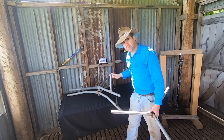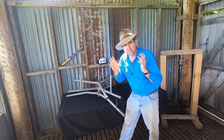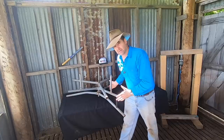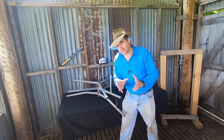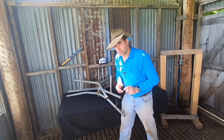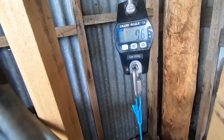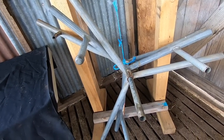Be careful when using these spinners to start and finish your run very slowly. The advantage with buying this sort of spinner is that it's as cheap as dirt and as strong as you can get — you can't break this with an axe. It's only good for running out plain wire, the brake doesn't work particularly well and there's no overspool protection. The simple Norton Gates spinner comes in at a respectable 9.6 kilos — that's just pure water pipe welded together with a couple of ends knocked on.